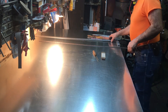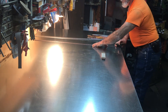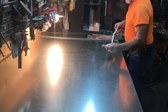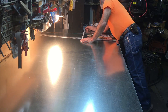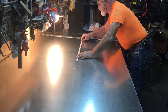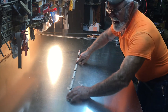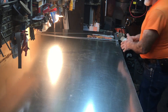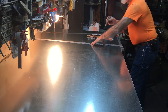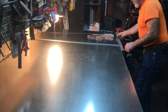When you lay out your cut-size pieces, there are a variety of ways you can do it. You can use a straight edge — measure in your cut size at two points and line them up. Or if you have a good, accurate four-foot square, you can make one mark reasonably close to the middle of your sheet of metal. It minimizes your effort and you know where to look for your scribe mark. It's important to have a drywall square that's really square — you don't want to mark them out of square.